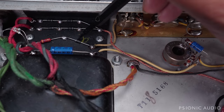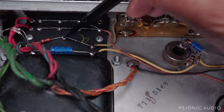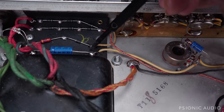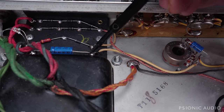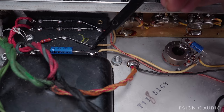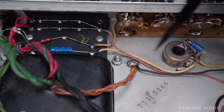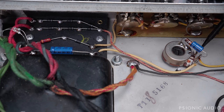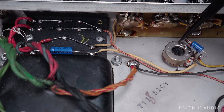Then it goes to this diode — the diode's anode and cathode arrangement is such that only negative voltage can go through. So the DC here is negative, and we have a bias cap here filtering off a large amount of the ripple, though not all of it — that's why we had that hum before. So we have a filtered but not perfectly filtered negative DC here, and that also goes off to the tremolo and to the bias pot. The input is lug 3, wiper is lug 2, and lug 1 has a resistor going to ground — the ground is the shell of the pot. I took this pot out, cleaned all the surfaces, got it nice and tight.